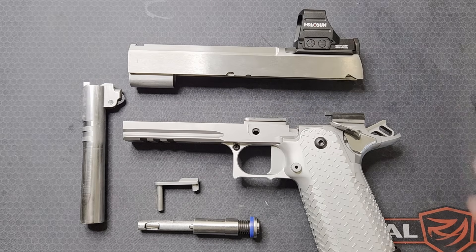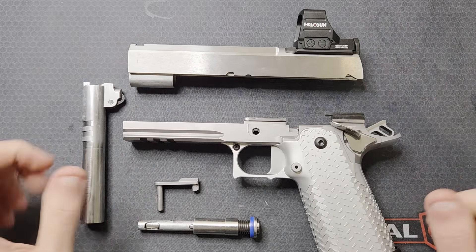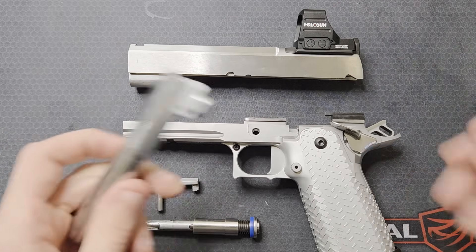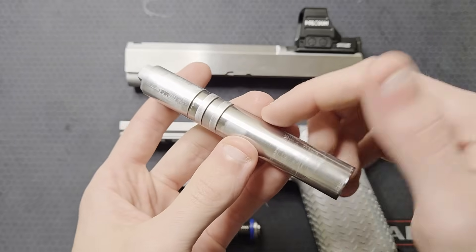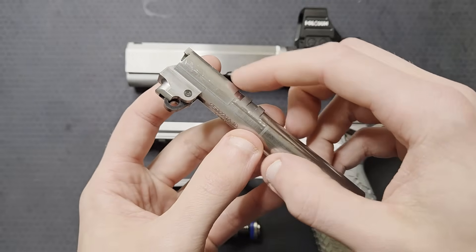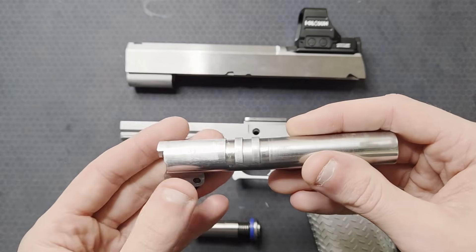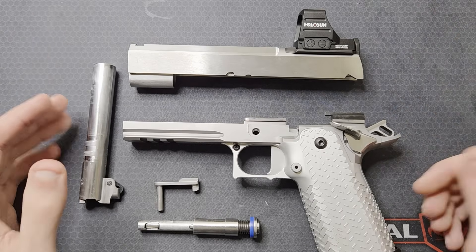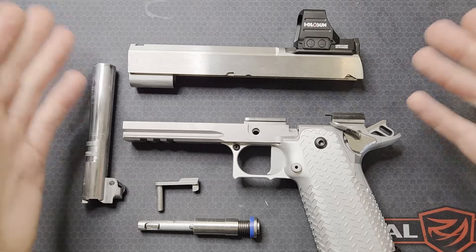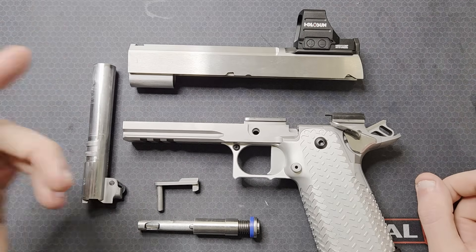What's up everyone? Surprise episode — well, a surprise to me. Here I was thinking I was done with barrel fitting. I recently test fired this thing and it ran really nicely. However, inspecting it afterwards, I was seeing some interesting contact marks on the barrel. The ones that give me the most pause are right here on the top and bottom of the chamber area. I don't think this is normal and it likely needs addressed before my slide and frame go out for treatment. I feel like these findings about link-down clearances and link length should be included in this series for completeness. Consider this an addendum to episode two about the barrel fitting process, specifically steps 11 and 12.